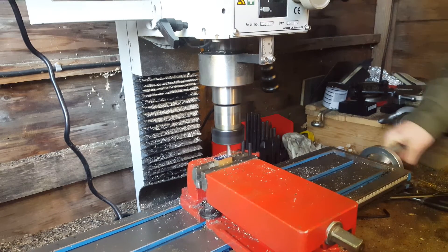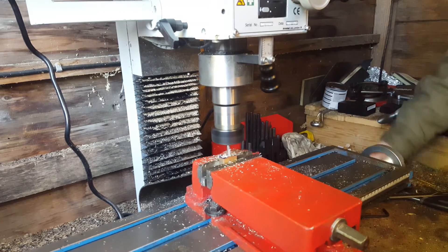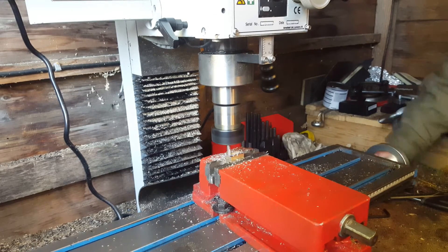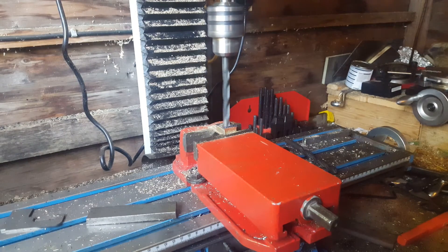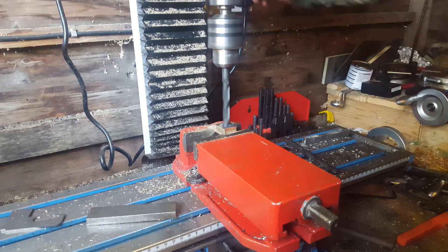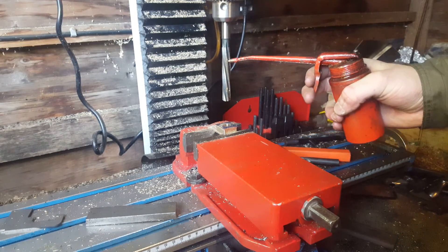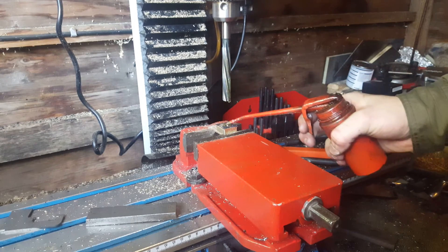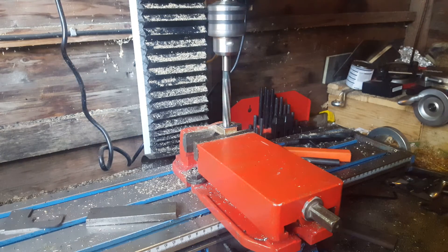These are gun metal castings — these axle boxes — and as you can see the quarter inch end mill cuts through them like butter. I did have a 3/8 inch end mill somewhere but I seem to have lost it in the shed; things do go missing over time and you never find them again until you don't need them. I did the reamer wrong — I left too much material in — but it's an old cheap reamer and I thought I'd just push it through; it's only doing two axle boxes, maybe three maximum.